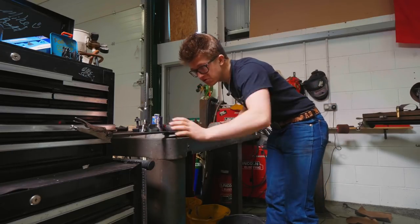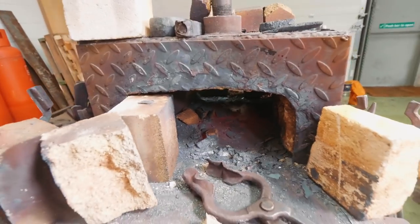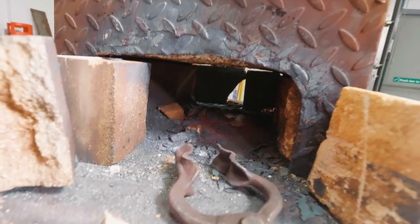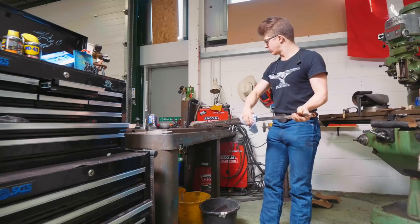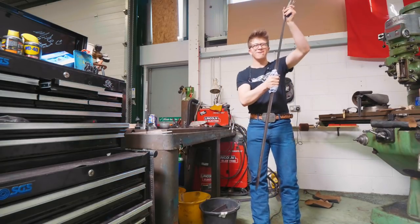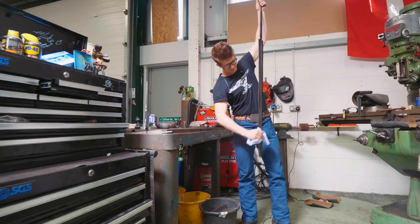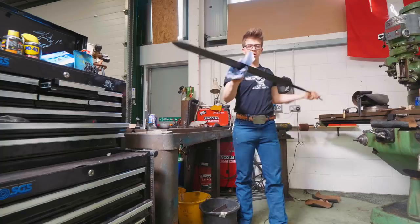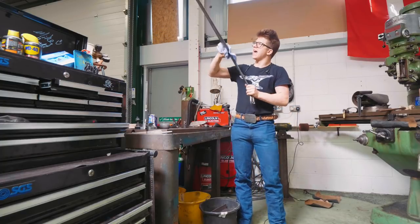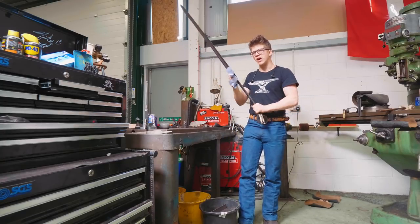It's also very dangerous because right now it's very brittle, and that bend — no way I can get it out now. In other news, guess who's got a nice cast steel floor in his forge — that's a great way to ruin the floor of your forge. I'm not really sure how to best progress from here or exactly how I'm gonna temper this, but I'm gonna grind this back to true material being very careful not to break it, and think about the tempering while I grind.